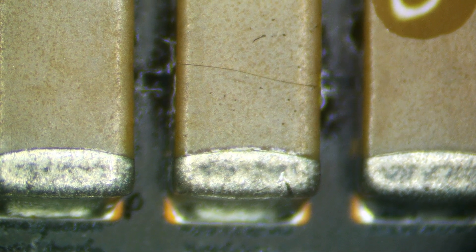The wire is down. We'll start at 11 volts — that should be sufficient. And I could already tell you which capacitor it is. Look at that — there's a crack. Now that there's heat going through it, we can actually see that crack expand. Watch that — it keeps expanding until we remove the voltage. That's pretty cool. That's where our problem is.